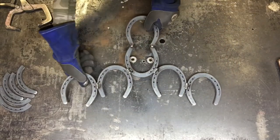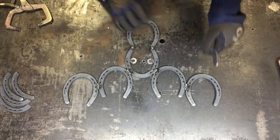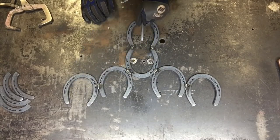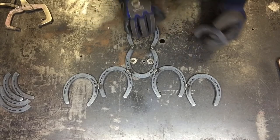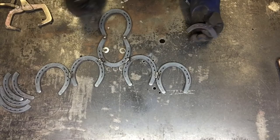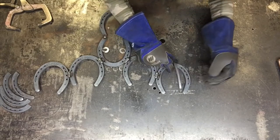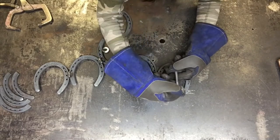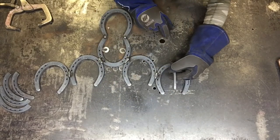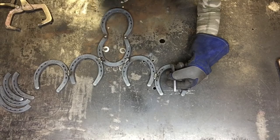Now, with this functional, our half pieces are going to be our hooks. Each antler is going to get one hook, and down here it will give him a nose but also be a hook. We're just going to eyeball this — if you're not happy eyeballing, you can use a square and find the center. I'm looking at the tip and centering it on the base of the horseshoe, like sighting a gun. I'm going to tack just the back side so I can adjust it left or right if needed.